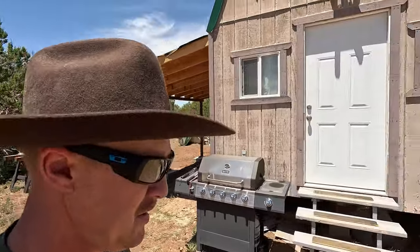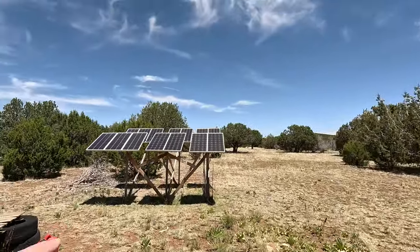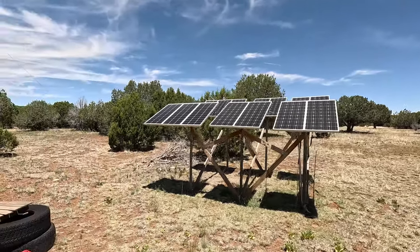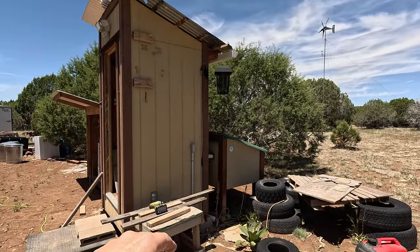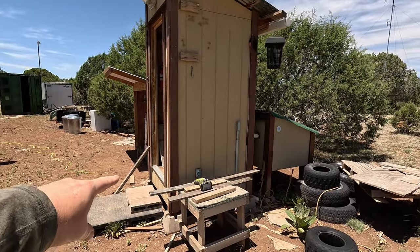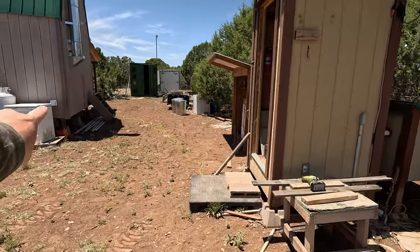All right, so I'm going to get some work done underneath this carport. Before I do, I want to show you guys a couple of things. If you're new to my channel, I have a very simple solar power system here. This whole property is off-grid. So everything comes from the sun, goes into my little power room through a charge controller, charges my batteries in that box there, and then sends it to an inverter, which I have run to a sub panel in here, and then the extension cord out to the cabin.